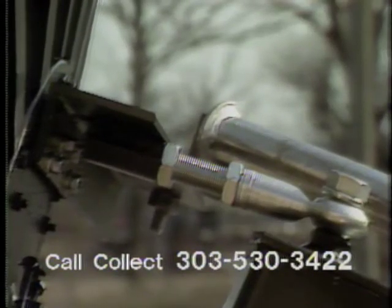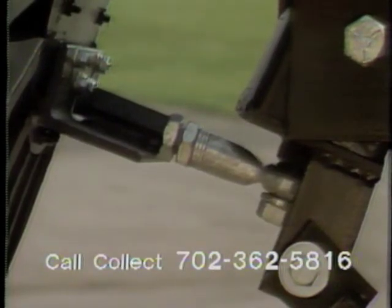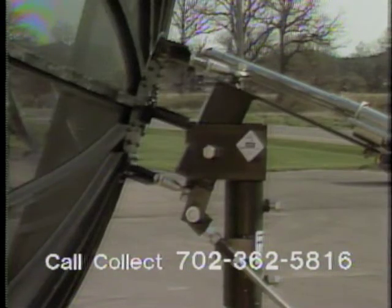The Trans 10 mount also has an infinitely adjustable declination offset to optimize the trackability of the system regardless of geographic location. Compare this mount with other mounts that you see on the market, and you'll find that the difference will be very apparent. The Trans 10, with its 10-foot diameter, has a deep dish design for maximum gain, a focal length of 44 13/16 inches, and an F/D ratio of 0.375.